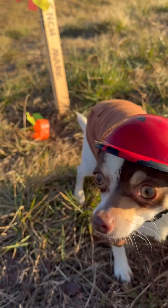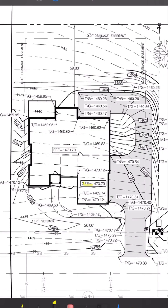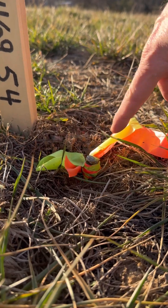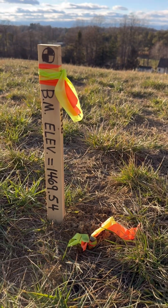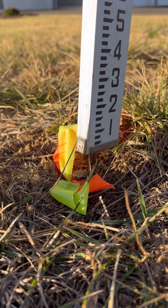The development we're building this house in actually requires an engineered site plan. They set the garage floor elevation at 1470.79 feet above sea level. I had the surveyors put a pin in the ground and mark the elevation. This gave me a benchmark to set all the different heights.